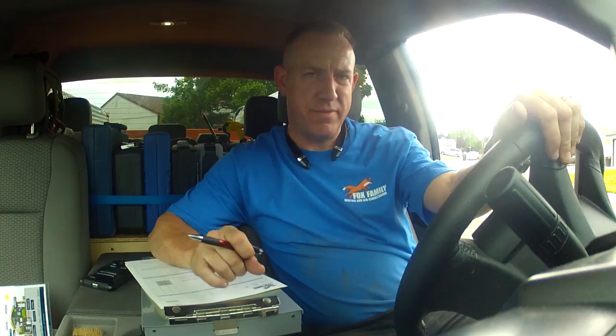I let him know the quote on a new control board and we can start from there, because he's got transformers laying around, wires laying around. I don't even know if his blower motor will work, but we've got to start with the brains — if the brains don't work, the rest of the body won't work. That system is a 15-16 year old Goodman GMT furnace, 50,000 BTU tubular heat exchanger. It basically needs to get that control board fixed before we can even move forward.